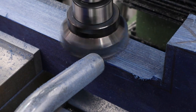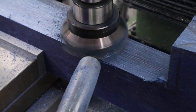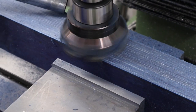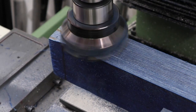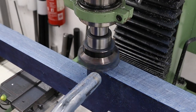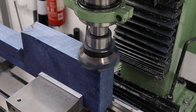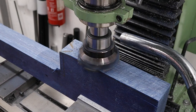I've got some laminated wood in the vice on the mill and we're just milling the bottom flat. This bit of laminate is an off-cut from another rifle we made a stock for, so it's already cut to the rough shape, but we're facing off the bottom first so we have a nice flat surface to work from. The part we just milled flat was the fore end of the stock and now we're moving to the butt end of the stock, again just milling this flat to give us nice flat faces to work from.